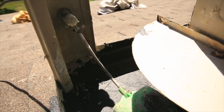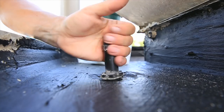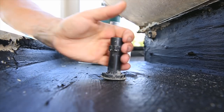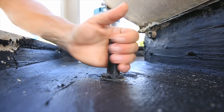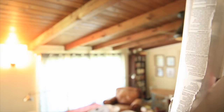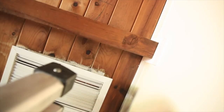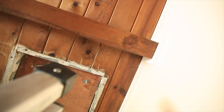You want to make sure your bobber is in place and also this plug, so that the water doesn't drain out of your swamp cooler once water starts flowing up through the little pipe. Now, this little plug I invented to help keep the heat in the house during the winter, but I've got to take it out now. It's really messy, but it's worth it — keeps your energy bills a little lower.